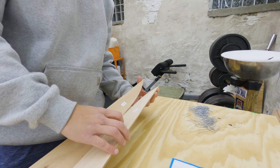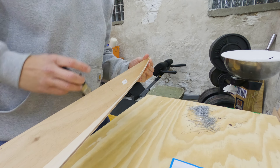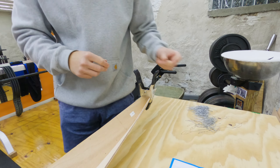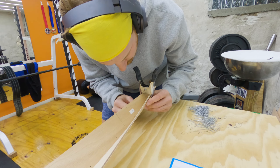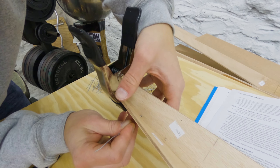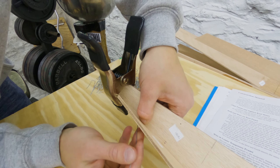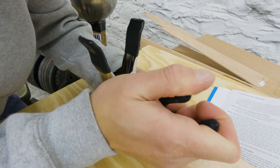Now go to the bow end of the two keel panels and twist the ends up vertically together. Align the ends and clamp them together with a quick-grip bar clamp or any clamp that can be operated with one hand. Insert the wires at the ends from the outside and bend them over the keel line and twist them snugly. Do this for the entire 14-inch section where you have holes drilled every 2 inches — all of these wires will have the twist facing out. After that, remove the quick-grip clamp, making sure you have not over-tightened the wires so that a pinched appearance remains at the end of the keel panel. Repeat this process on both sides.